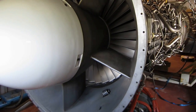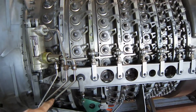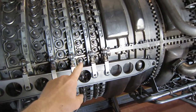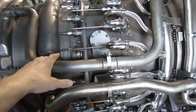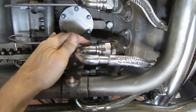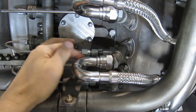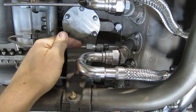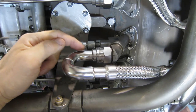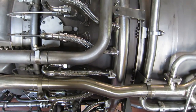There's the inlet with the IGVs in the closed position. We've got the actuating ram with the lines going to it, and the linkage bar which moves each stage in unison. These are water injection lines. There are dual fuel nozzles in the engine. So we're feeding the gaseous circuit with propane or natural gas — normally the engine runs either on natural gas or liquid fuel. What we're doing with this engine is running water into the liquid fuel cycle, or circuit, of the fuel nozzle while we're feeding it fuel in the form of natural gas. It's a way to augment power and reduce emissions by cooling the temperatures of combustion.